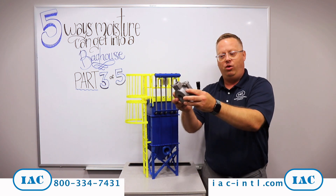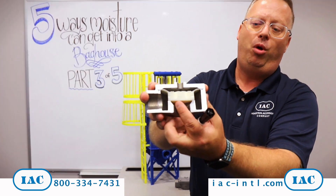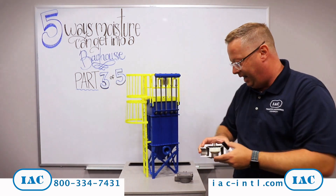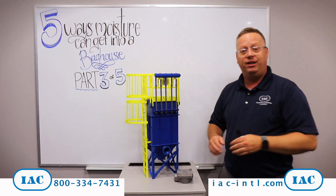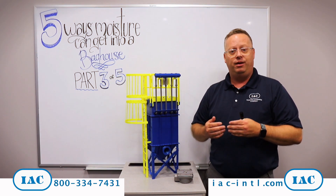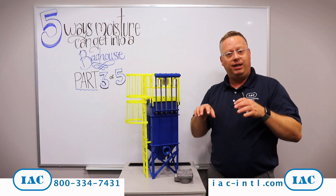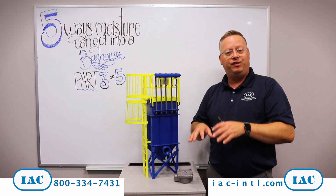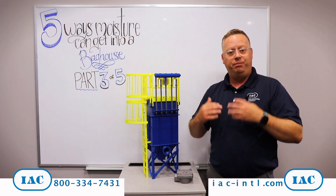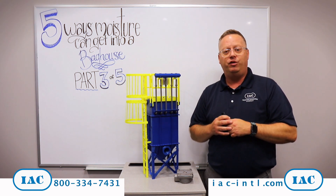This is an example of what a diaphragm looks like. When it pulses, that diaphragm releases and delivers that high-pressure compressed air down into the baghouse. If your compressed air at your plant is not dry and clean, it will bring moisture and desiccant with it. If it does that, it will deliver it down the blow pipes and deposit it in the clean air plenum and in the filter bag itself. As we've talked about, baghouses don't like moisture, so that moisture can build up and start to cause problems with the function and performance of those filter bags.